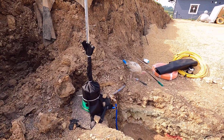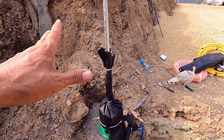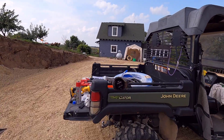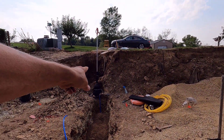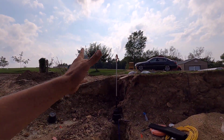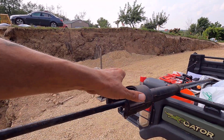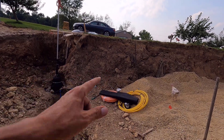I'm getting a little bit of help from a turkey here and there. The yard hydrant is complete — I'm going to trim this stuff off but I'll do that later. Now I've got to get the curb box on, and how I'll do that is to pull this rod out all the way, take the cotter pin off, connect it to the top of the curb stop, then slide the curb box over the top of that and connect it to that board. I just need it standing fairly straight. As we backfill, I'll straighten all this stuff out with a level. Once it's in place and strapped up to that board, I'm going to go to the bottom and wrap some landscape fabric around that as well.